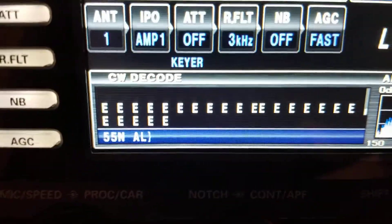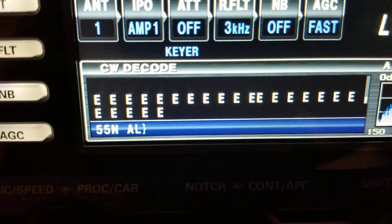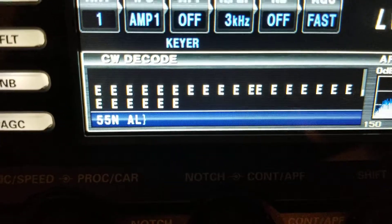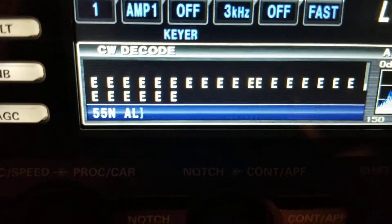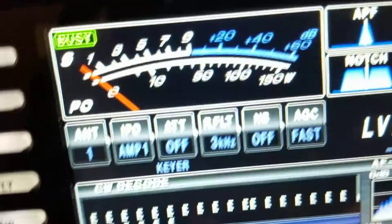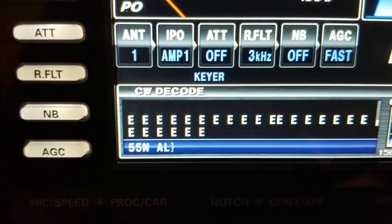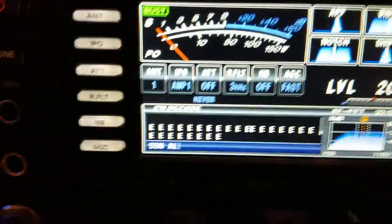So this window function on transmit is the opposite of the 1200 — it doesn't show anything in CW when you're transmitting on a 3000, it does on a 1200. On the 1200 with the break-in key off, it shows whatever you're sending and any messages in memory put in by the keyer. On this one it shows nothing when practicing with the break-in key off, and it only shows messages in the decode window when they were entered via text. So those two functions are just the exact opposite on these two radios.